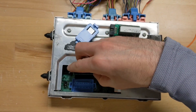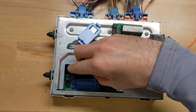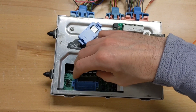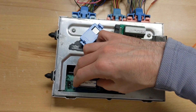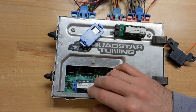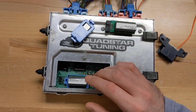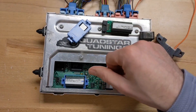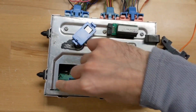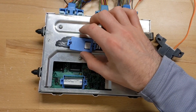Hold the chip beside the socket and make sure your pins are lined up, because you can get it installed the wrong way since we don't have an indexing system. Just make sure all your pins are lined up. You can kind of feel it when it's going into place, and once it's there it'll go down a little bit. Don't be afraid to push it until you know it's all the way down on both sides. Now you're installed properly.